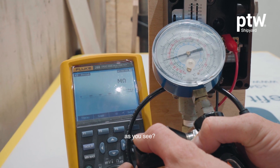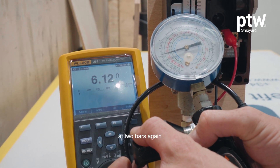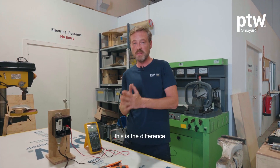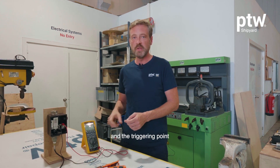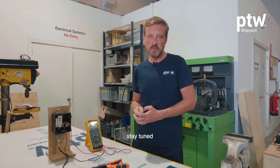As you can see, it opened its contact at 2 bars again. So, what is the differential? This is the difference between the set point you have set on your pressure switch and the triggering point — when the pressure switch will trigger. Stay tuned.